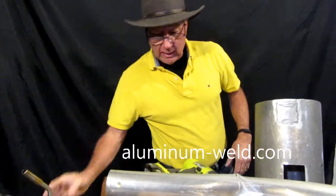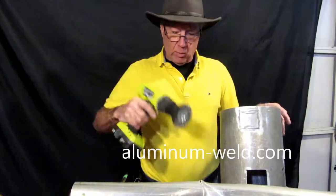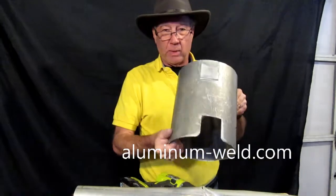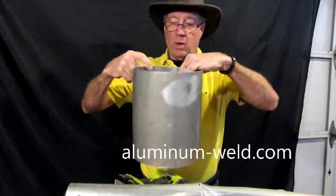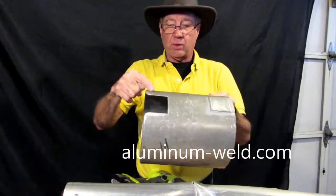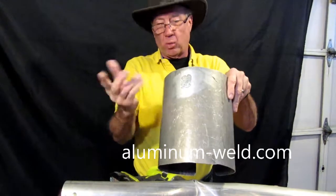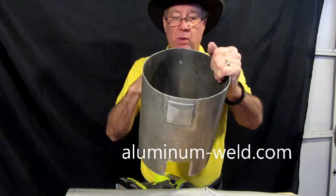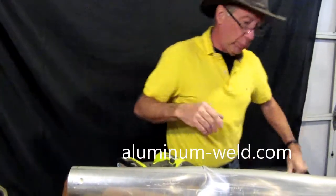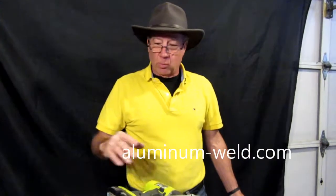The first thing I've got to do is clean off the oxidation off the aluminum. I'm going to use this drill and a wire wheel — that's what I did on this piece here. This is a larger piece of irrigation line. I had a large hole here, so I put a patch on it. A smaller hole, like a .22 caliber hole, is very easy — just go right over the top of it. The rod will bridge three-eighths of an inch very easily. So I'm going to clean this up and then we'll do the repair.